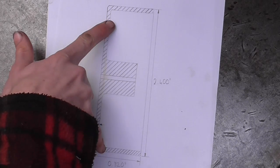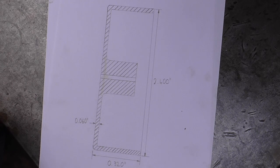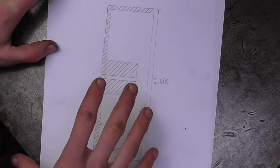So it's about 2.4 inches in diameter with a wall thickness of about 60 thou, which is a mil and a half. Rather than give a lengthy explanation on how I'm going to do it, I'll just go ahead and show you all the operations and you can follow along. At the end we should have a couple of finished components.